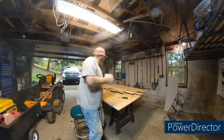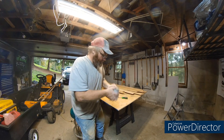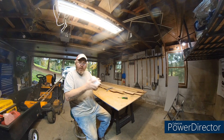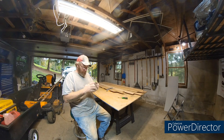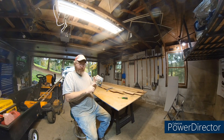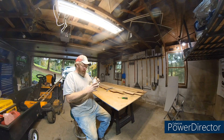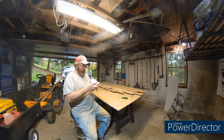Alright, I got all but the two pieces that we had to fix sanded and ready to go. Make sure you shake your stain up really good. If you just bought it, it'll probably be right where we need to start. We are using Carbon Gray Varathane — dries in an hour, achieves color in one coat.